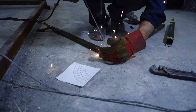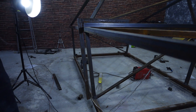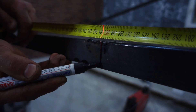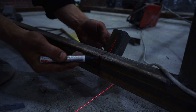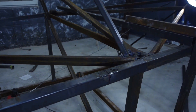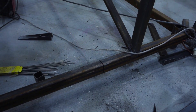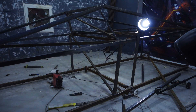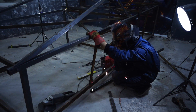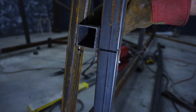For the side elements, we need to make an angle with an initially specified degree. According to this template, I'll weld the side elements of the faces, but first I'll make a starting point — more precisely, a vertical line which will be called zero. All dimensions of element positions and welds will be laid from it. This line runs vertically through the entire body from the top and ends on the slipway. For the faces of the door, a support construction will be welded so that the angle remains correct and one of the pipe walls will be parallel to the template.